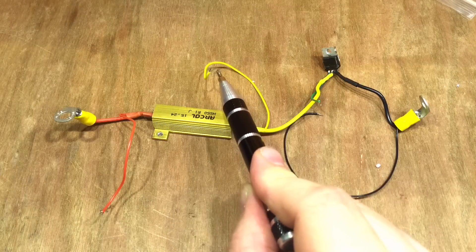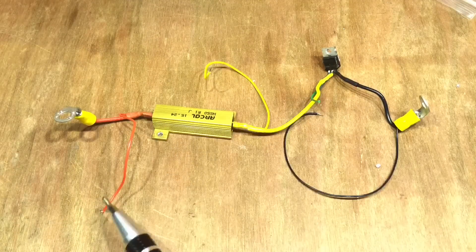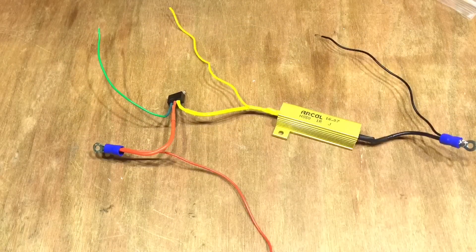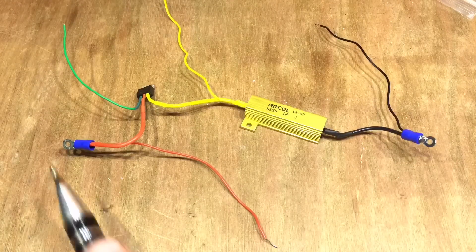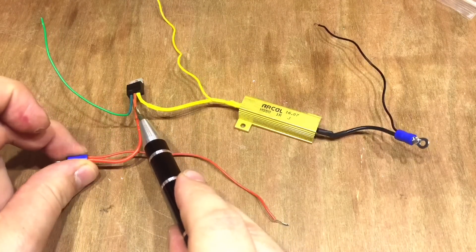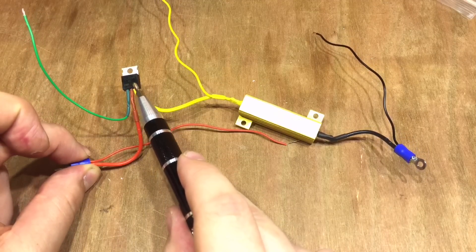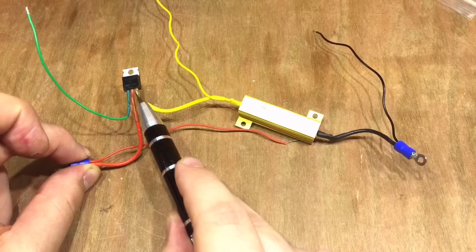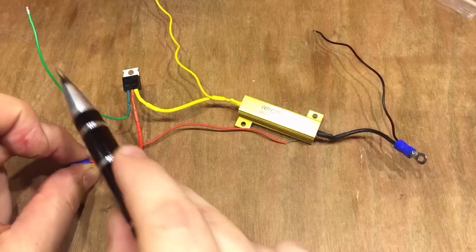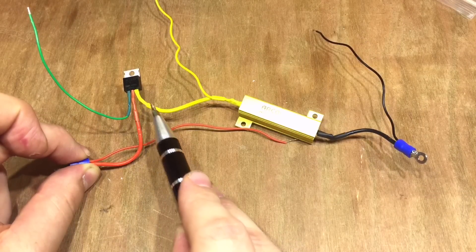There's a cable to make sure both sides share the same ground points. We were sensing the voltage at this point on the yellow cable and this point on the red cable — and it didn't work. This is our new and improved version: the positive of the DC load being tested goes into the drain pin of the IRLZ44N N-channel MOSFET.